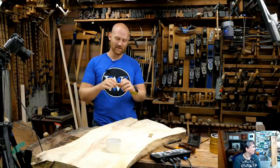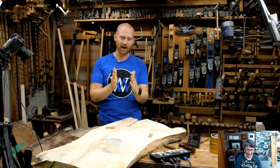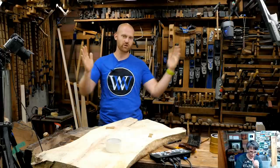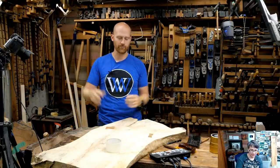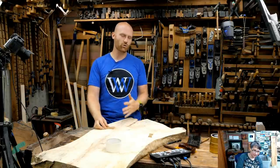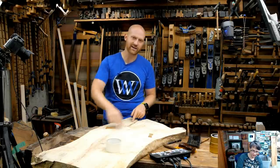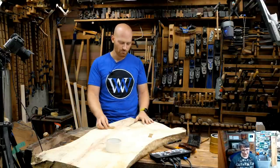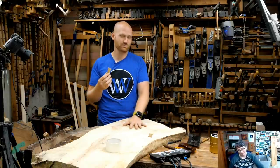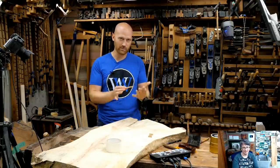So, back to the butterfly. What it will basically do is, especially if there's a crack, if you have any expansion and contraction of the wood, that crack will open and close and open and close, and slowly it kind of works itself longer, larger. And for most cracks, if they're small, you know, 5-6 inches or less, like this one, I'm probably not going to need to do that because it's in a crotch. The crack isn't going to go down farther. It's going to dead end into that crotch. So I don't need to worry about that as much. But I like the look of bow ties, and so I'm going to use it on this particular one because I want to fit in a little more intrigue. So I'm going to be putting a bow tie in here.